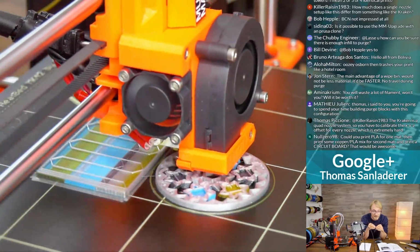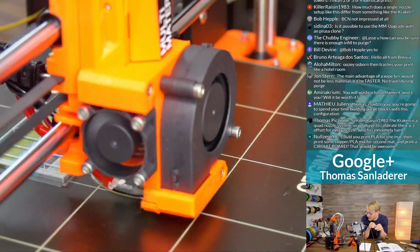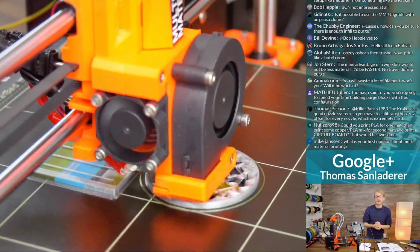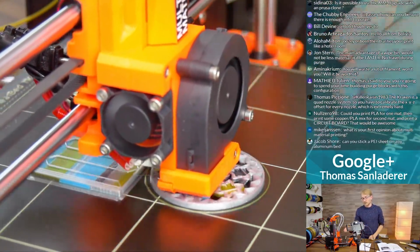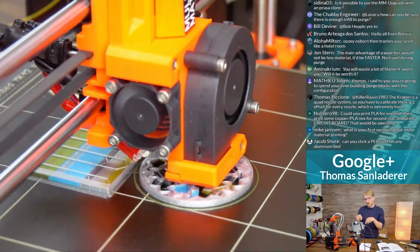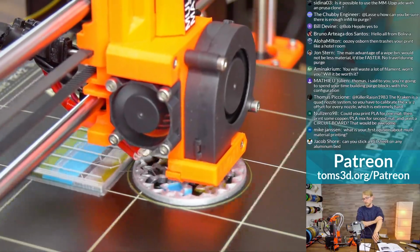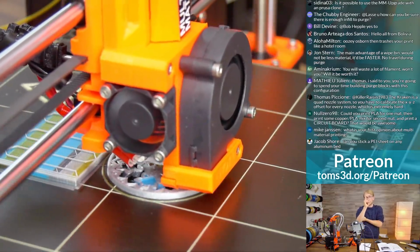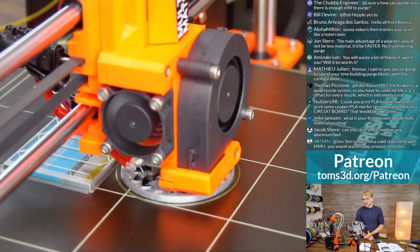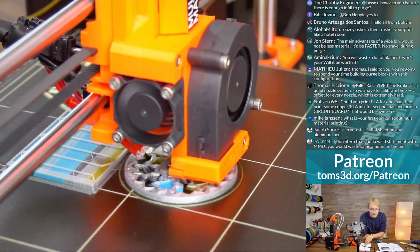Yeah, Kraken, same thing. Again, multiple nozzles, you're going to have some sort of an offset between the individual nozzles. With this one, with a single hot-end single nozzle, you just have to worry about which material you're feeding at which time, but you are only going to use one nozzle, so no shifting around of these 2. It all has its ups and downs.